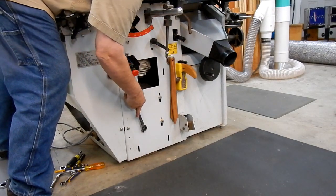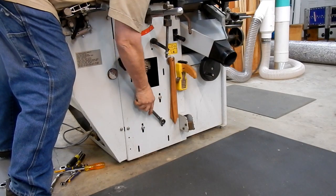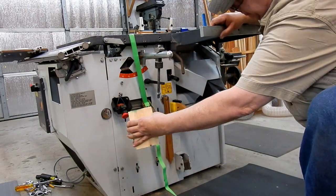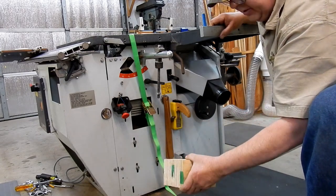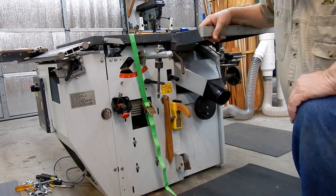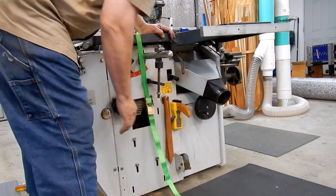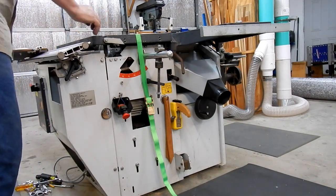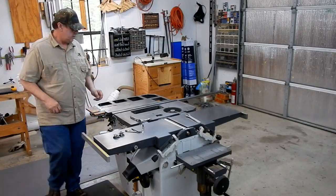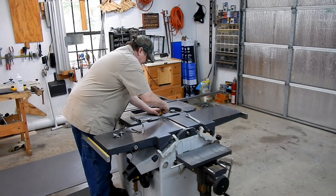You don't need to loosen these a great deal — you just need a little bit of slack in them so you can lift that motor. The last time I took loose these belts, I took a block and put it up underneath that motor on the inside and wedged it up. This time I'm going to try to pull it up with a ratcheting strap — and this works much better than the block. Now we can reach in there. It's easier to take loose the belts from the bottom than from the top. Now it's time to get the belts off the top side — just let them fall free. There's the second belt.